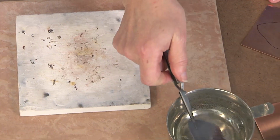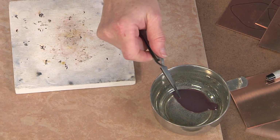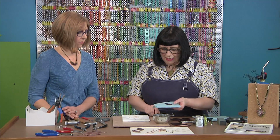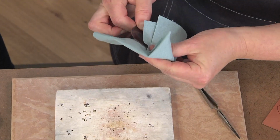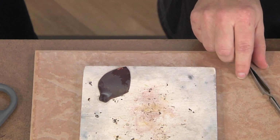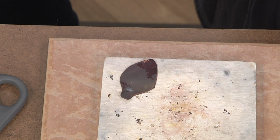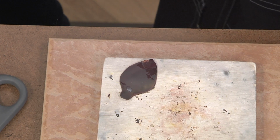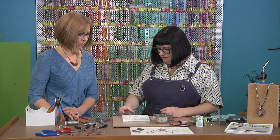Once I've done the annealing and heating it with that torch, you can see how dark the color is. But I'm going to come in and give it a quench in my quenching bowl. Now, you can see some of that darkening has actually lightened up a bit. And I like to use this coloration for the actual color of my leaf. So the fire scale is really adding to the color. Yeah, of your finished piece. I think it looks really nice. We're going to do some other patina techniques in a little bit, but this is the start of that.